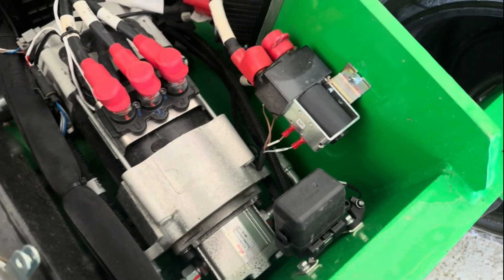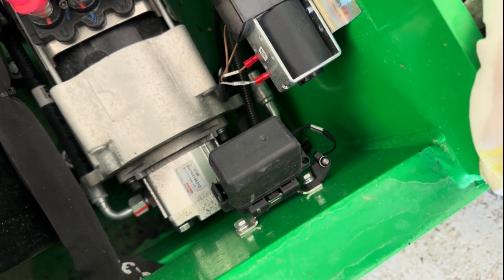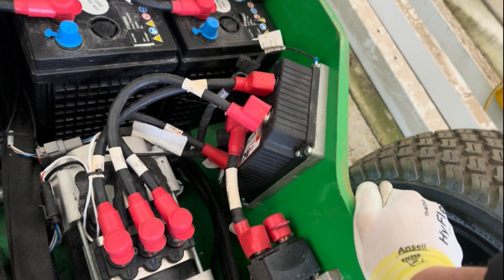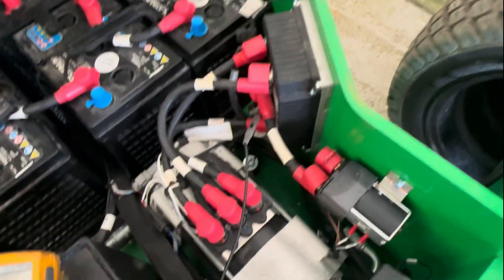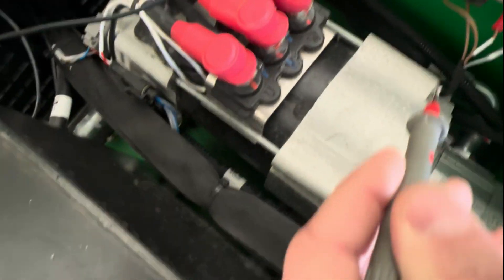At the front now — that's the pump controller, and the LED is flashing one-one, which is a status light showing there are no errors with it. I'll do a voltage check on the phases now while the controller is operational, and then trigger a fault to see what the phase voltage does. The ground is connected; contactor supply is 48.28 volts, and the output on the contactor is 48.28 as well — exactly the same, so the contactor is on.